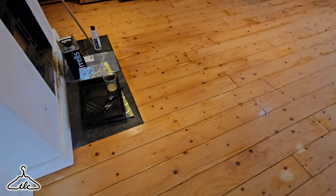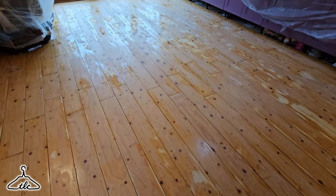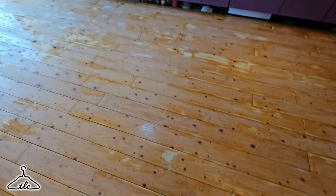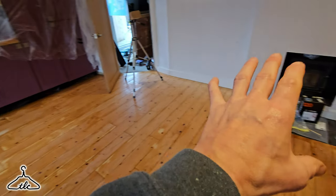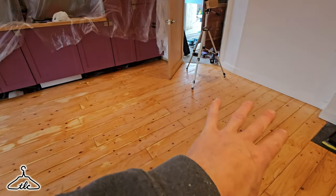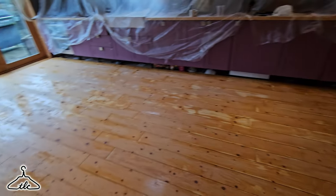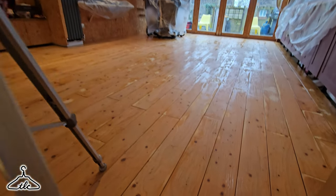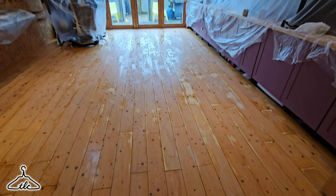All the cutting in is done and it's caught — went around all the edges. As I was doing it, I was tempted to just touch up all the white spots, so I did that too, just to give it a little helping hand. You can see all the little wet patches — that's me touching up all the raw softwood bits. That's nearly dry now. I started down this end and finished down this end. By the time I mix up another batch for the roller, it should all be ready to walk over and give a solid roll with the 9-inch gloss roller. I'm just happy that it's all flake-free now.